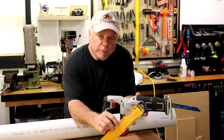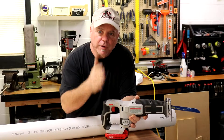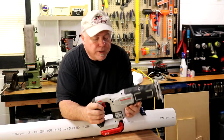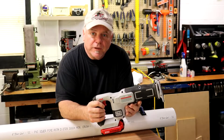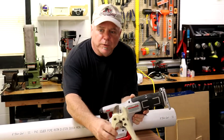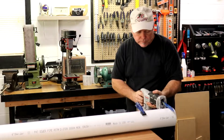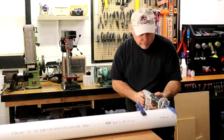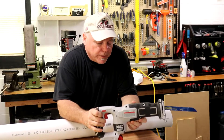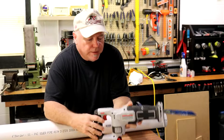You've got to be careful with the reciprocating saw if you're cutting an eight-inch pipe. You'll have to cut a ring around it, as opposed to just slicing straight through it. I'd say this is very effective, very quick, makes a fairly clean cut. It will need dressing after the cut. It's not like the squeeze cut that we used previously. This is my preferred method on anything two to three inches and above. Like butter.